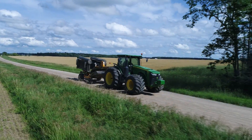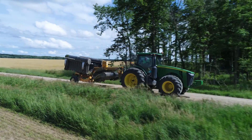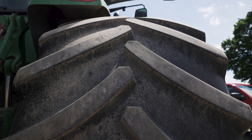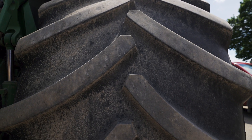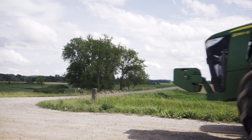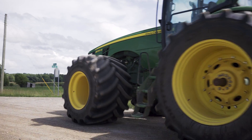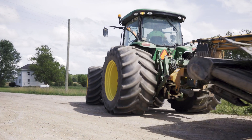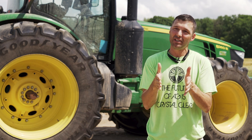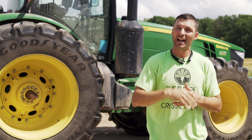Now I plant all the 15-inch rows behind the LSWs. What we were seeing is amazing during the wet years. The lack of footprint was so good that the standard row crop tires would actually create a channel for the wagon, and then the wagon would sink into it. So this thing would skate over a wet area, and the wagon would float right over the top because it wasn't pinching that area down.